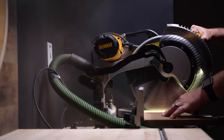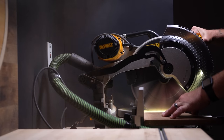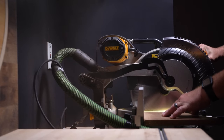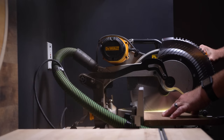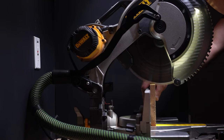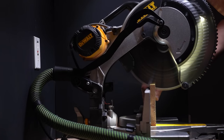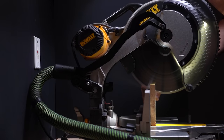They don't go low enough or wide enough to catch the dust in the first stage of the cut. This is most apparent on wide thin stock, as the dust created originally gets flung at a very low angle and then gradually changes the deeper you get into the cut until it finally reaches the dust port. On taller stock, this isn't as big of an issue because the angle that the dust is being ejected at is already relatively in line with the dust port.